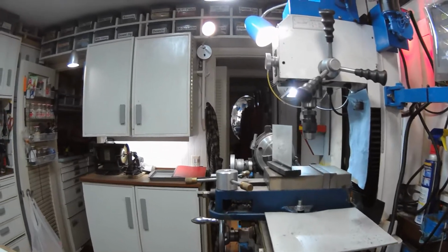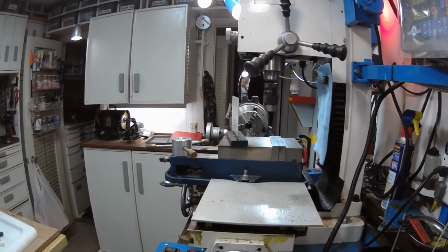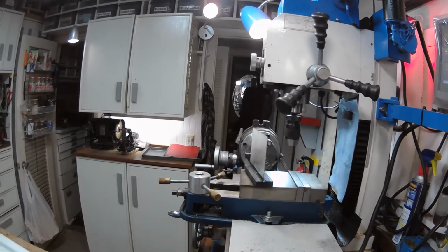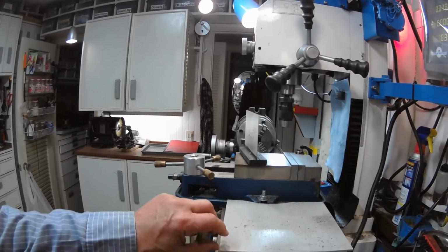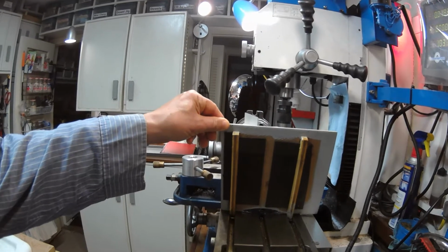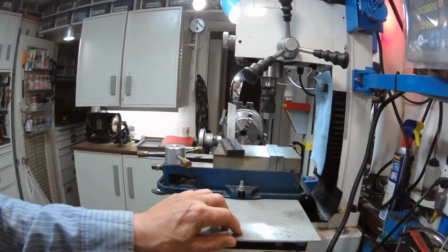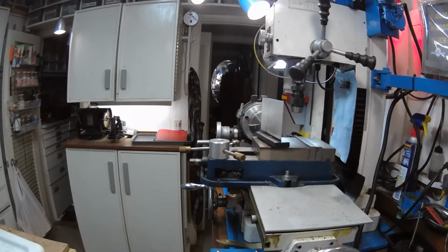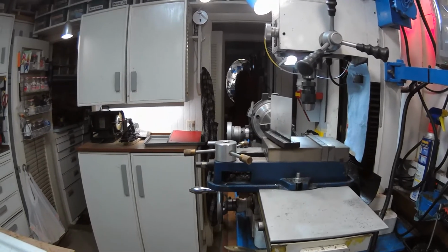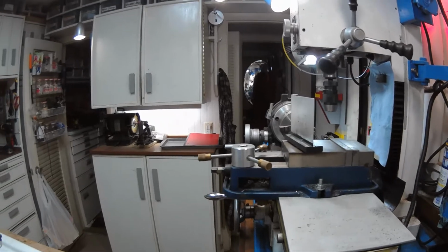The other thing I think you might consider is I made these masonite panels to cover the table. I leave my vise in the center, more accurate milling, and it's easier. But this is just a piece of masonite with some strips on the bottom and some non-rusting shelf liner. And the strips of wood simply fit into the tracks on the table. And this is a lot easier to clean. And if you drop something, you don't crack an end mill and you don't damage the table.